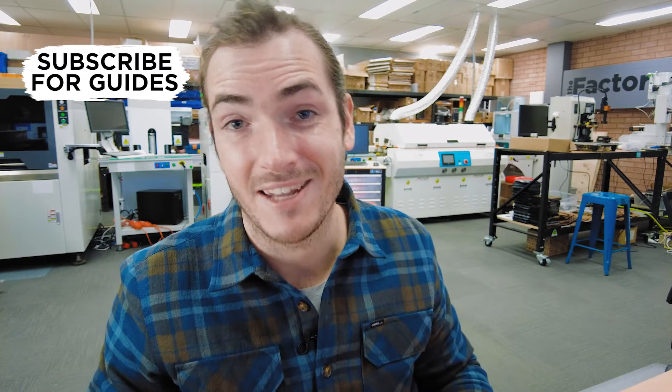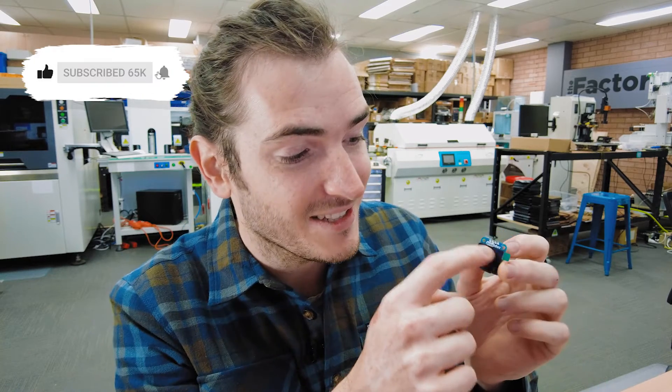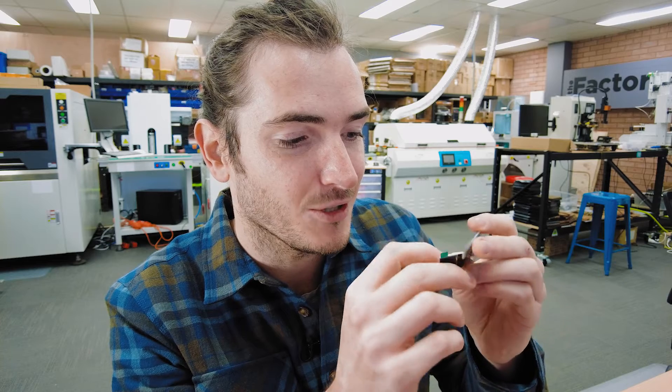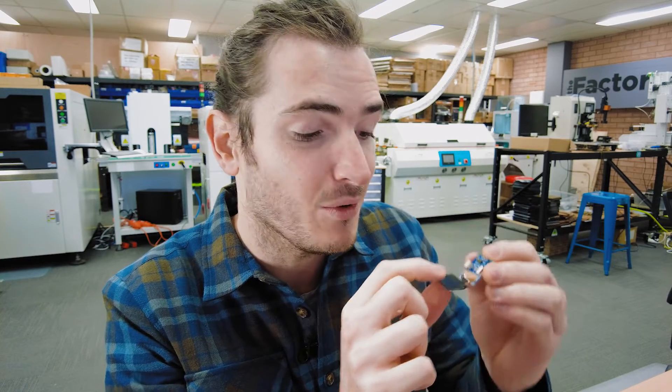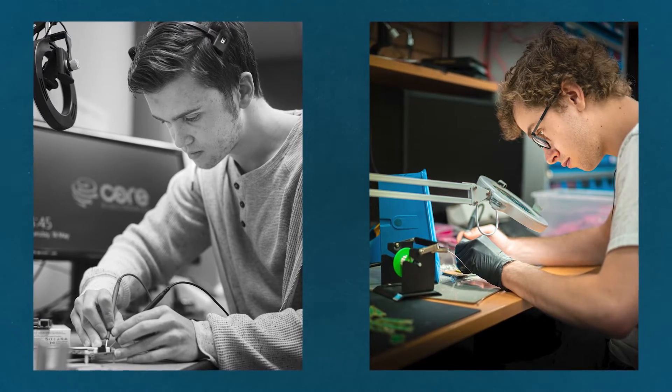It's also one of our most complicated modules to assemble. This OLED display is actually held onto the module by a flat flex cable, and this cable has to be soldered to the board because we can't find anybody that makes a surface mount connector for it. This soldering operation is really demanding in terms of skill and attention — of everyone at Core Electronics there's only about two of us that can do it reliably. Liam and Bryce have been assembling these using a special T-shaped soldering iron and the process works quite well, but it's very slow.